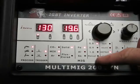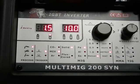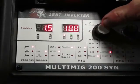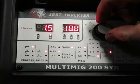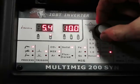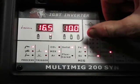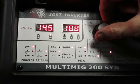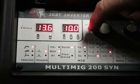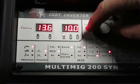Another thing you can do is go down to manual. In manual you push the button and that takes you to your voltage — push the button again and you've got your wire feed, then you adjust that. It goes up to 16. For three-sixteenths I think you'd be running around 13.6 wire feed, and for voltage you could run up around 21 volts.